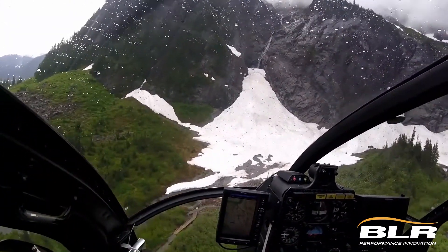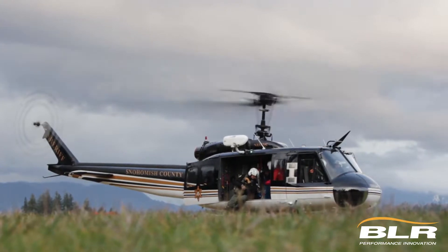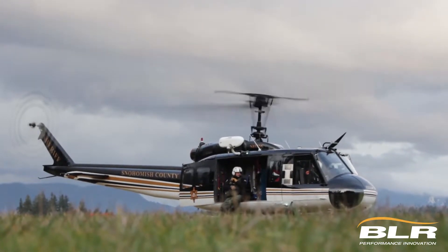That's what we do up here in Snohomish County in search and rescue — we operate at high altitudes, anywhere from six to ten thousand feet is our typical range for rescue operations. When I come in on a mission at those altitudes, I don't come right in and conduct the mission. The first thing I do is check tail rotor authority, pedal control, and cyclic control. I'll stand off away from the mountain at whatever altitude we're going to conduct the mission — six thousand or eight thousand feet.